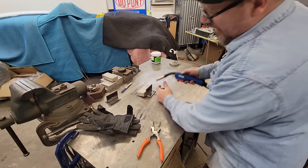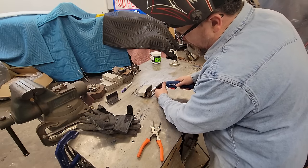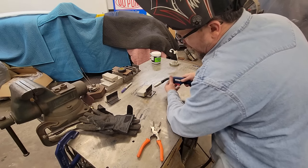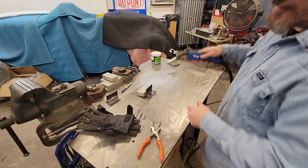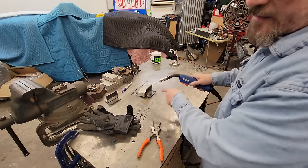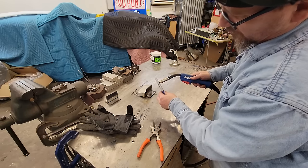You can determine that by, I hold mine like this with the gloves on, of course, and I get my height, and you can come out through here and you can slide your hand if you got a good clean table, or you can roll like that. But if you'll do that, get your height that you want, and you got the same height the whole time. That's part of the consistency. Don't dig it in and start bringing it back here, it'll start spitting and sputtering real bad. You'll know if you go in a little closer, keep that half inch or the width of the Sharpie, pretty much the same thing.